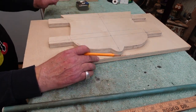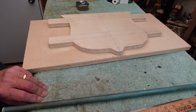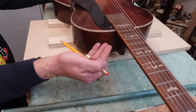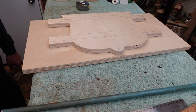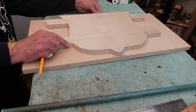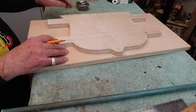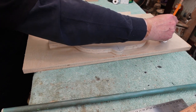I'm going to put this top on, except there's one thing different — I'm not going to need this on the top one because everything has to clear. The neck is going to come off there, plus I'm going to need a pocket right here where the fingerboard sits. If I'm pushing this up and this is clamped over the top, I'll need a space so when I push on the bottom the fingerboard portion of the neck can come out. Instead of trying to figure the distance out, I'll just line the center marks up and trace this, then cut it out too.